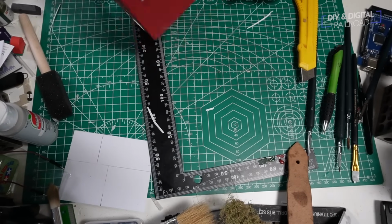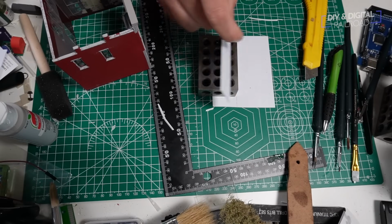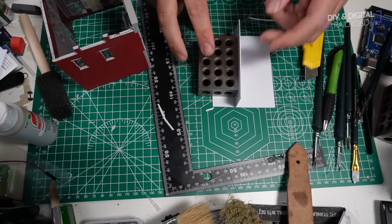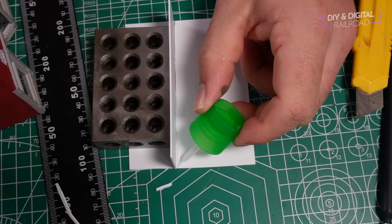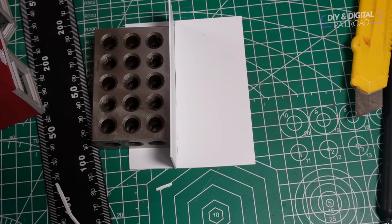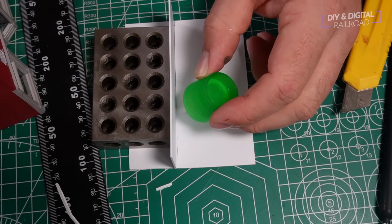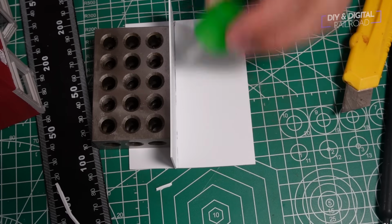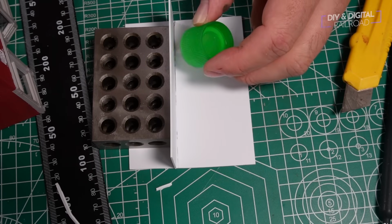I always do a bunch of test fits before I'm ready to do that. And this is where 1-2-3 blocks come in. I'm going to put a link to these in the description below. These are absolutely crucial to model making, especially if you're doing right angles. And I'm using some Tamiya Cement, and basically what this does is a chemical reaction that pretty much welds the two pieces together and will kind of melt them and then fuse them.